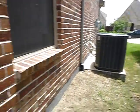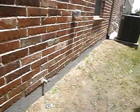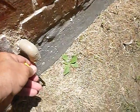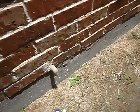We've got a separate video for the condensing units. We've got a separate video for the water heater. A shorter one, trying to help. Here's one thing I didn't mention on the water heater video, but this is 6 inches, so that's the pressure relief valve drain line, and that's proper.